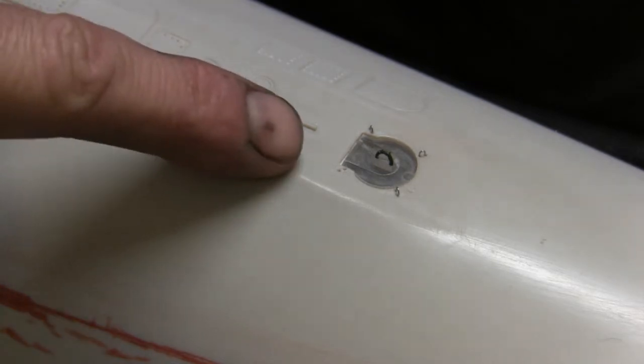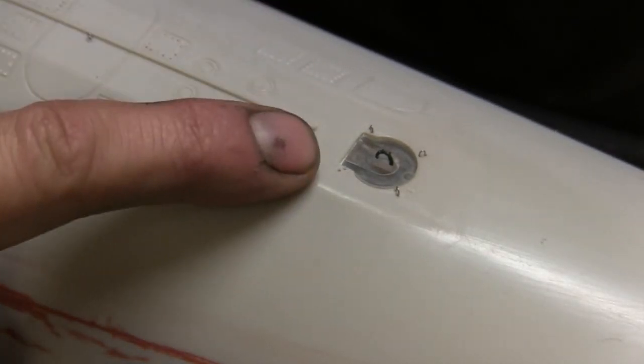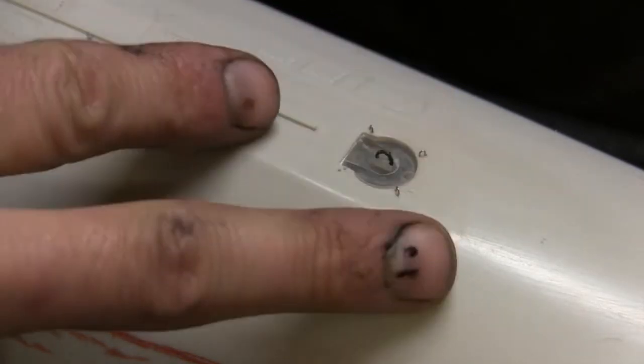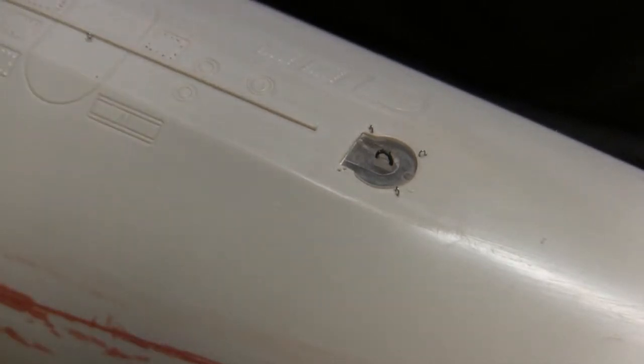With the sail detailing out of the way, it's time to circle back to the hull to finish off the last of the details to get this thing ready for painting. Which brings us to the hatches. Both the bow and the stern hatch, as I may have touched upon before, have details that are integrally molded into the tooling, which are mounting locations for the four little securing points that are found around the hatch. On the real submarine, these are for a diving bell to strap to the submarine in order for the crew to exit the boat underwater in case there's an emergency.